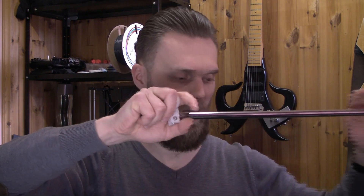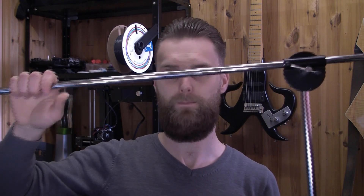Because this is based on the original camera slider, I'll again use the microphone stand. The diameter of this microphone stand is 14 millimeters. I'll make designs for different diameters as well. With the stepper motor, you can use a long tube and make a very cool time-lapse over two or three meters. Maybe later in this video I'll make a time-lapse across this whole room.